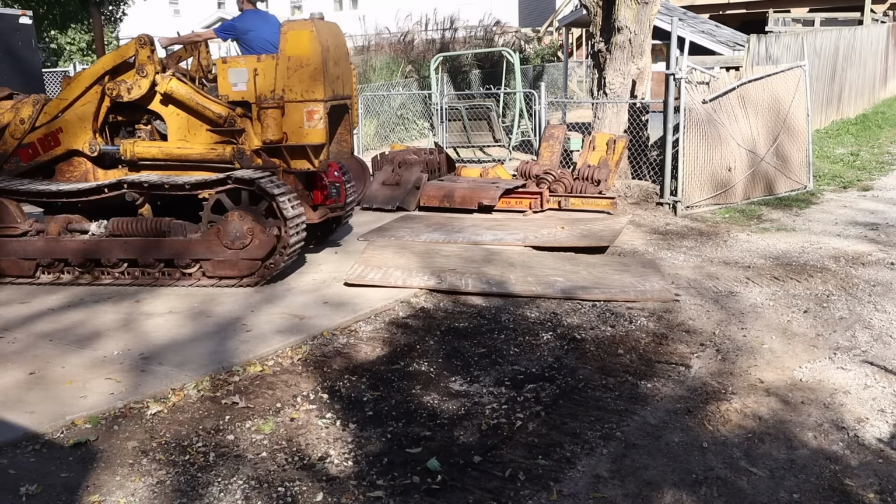So this is the valve cover. This goes on, basically the last thing goes right on top of the motor. And I happened to be looking through some of the gaskets and things that I had from the other building when I got the machine. And it looks like this is a replacement valve cover seal. In good enough shape. I mean, it's a cork, definitely still pliable. It's a little dirty. I can wipe that down. So, since I've got it already, I might as well just pop this one out and put that one in. Looks like they installed this with some RTV. That's what this black rubbery stuff is.